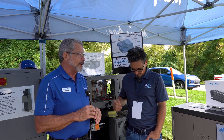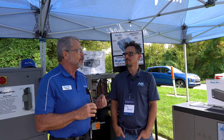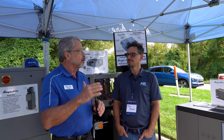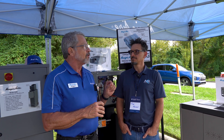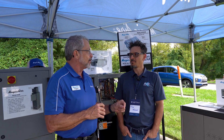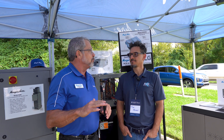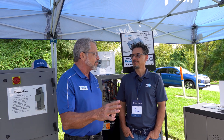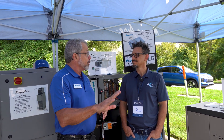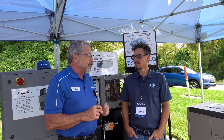There's more and more conservative practice and safety factors being built in so that DX equipment is frequently oversized. If you have a standard single-speed compressor in a unit that's a little oversized — and oversized because they have to size it for the worst case, like 50 kids in that classroom someday — a single-speed compressor is going to short cycle and you won't dehumidify very well. All that stopping and starting is really hard on all the components. But a variable speed compressor — say you have a five-ton unit — it just runs at two tons. Super efficient, super quiet, as low as NC35 sound levels. Unit ventilators are a big part of our business.